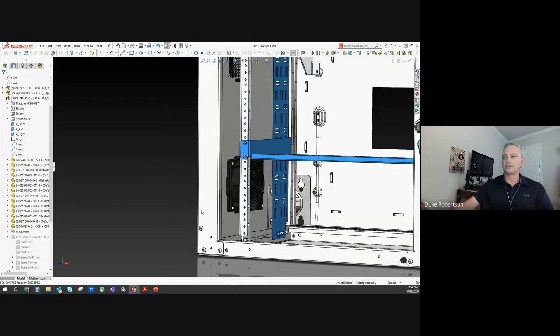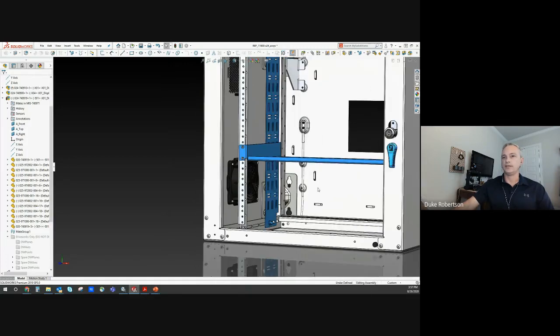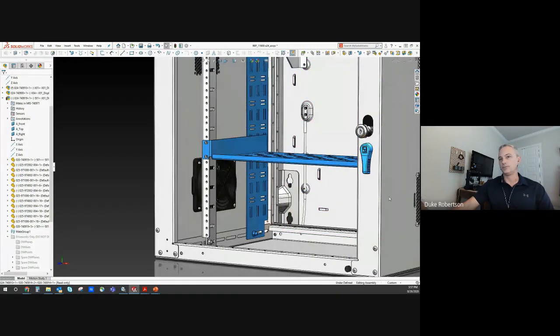So if you had an exhaust fan that was pulling hot air out, you're now creating essentially a vacuum inside the enclosure. And of course, where these things are typically installed, you're going to be sucking in a lot of dust. So that's why we do the opposite. And the reason why we recommend the fans being installed where they're shown here.